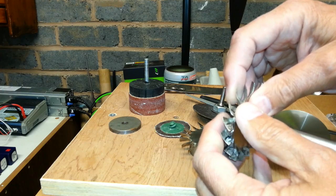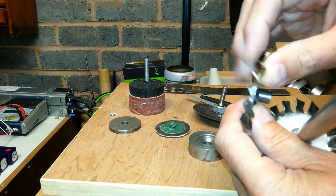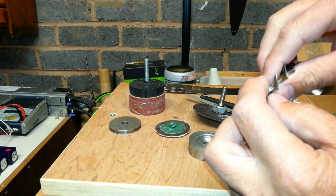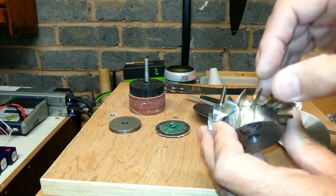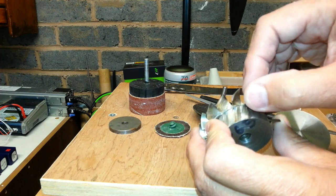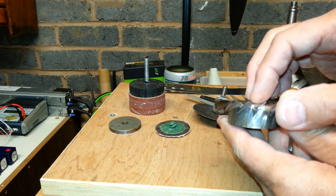You must take some of this twist off. Once you've twisted it to 37 degrees, you've got to untwist it. While it's still fairly thick like this, you're probably better putting it back in your clamping setup and using your claw tool to try untwisting them. They want to be untwisted quite a bit - ten degrees or so.